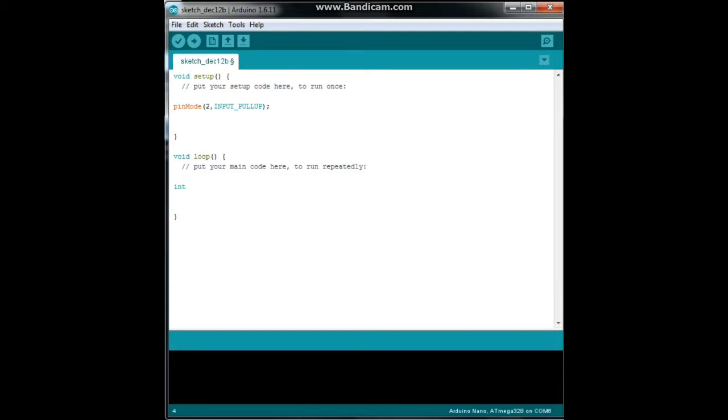What we've done here is we set pinMode to INPUT_PULLUP. What that means is it sets this pin to a logic high. So as long as the button attached to that pin is not being pressed, we have a logic high. And then we're going to turn on our serial comms so we can see what happens.